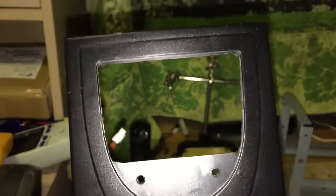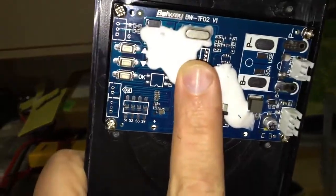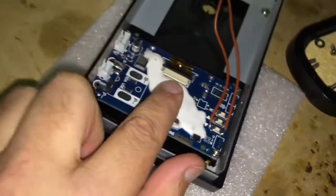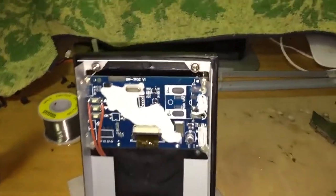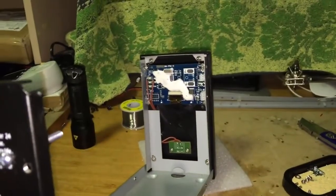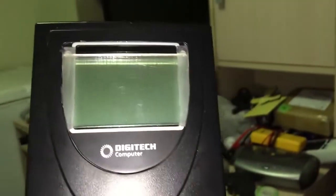I've just had to widen the size of the housing. I need to scratch off the plastic on the sides because the screen is wider. There's the new LCD screen — it'll line up nicely. I'm reusing the front button as the up button to reset the power meter. I've got the LCD screen mounted in the front — that's a pretty nice install.